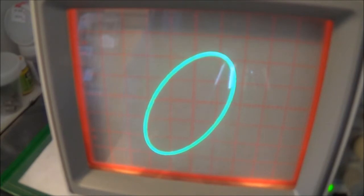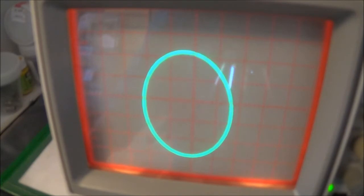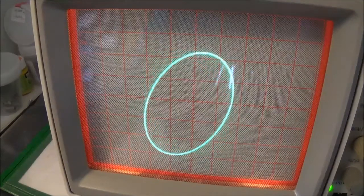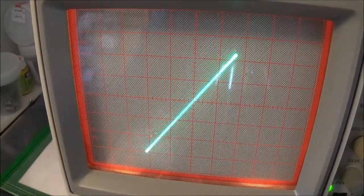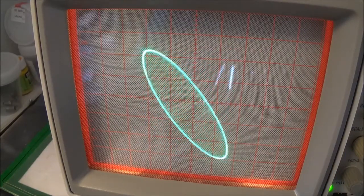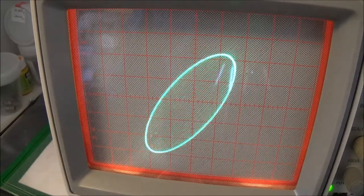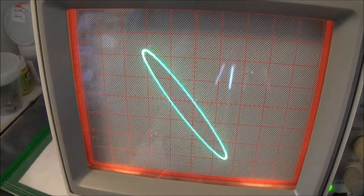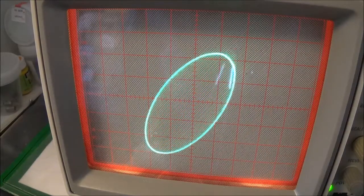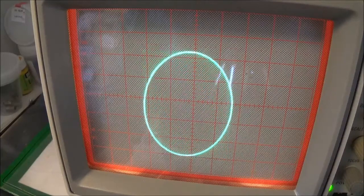What we're going to do is compare the ratio of the loops — or circles — in order to get the ratio of the frequencies. For example, if we had a two-to-one loop ratio then we would also have a two-to-one frequency ratio. I'm going to set up my known frequency on the signal generator, feeding the signal into the X input, at 2000 Hz.